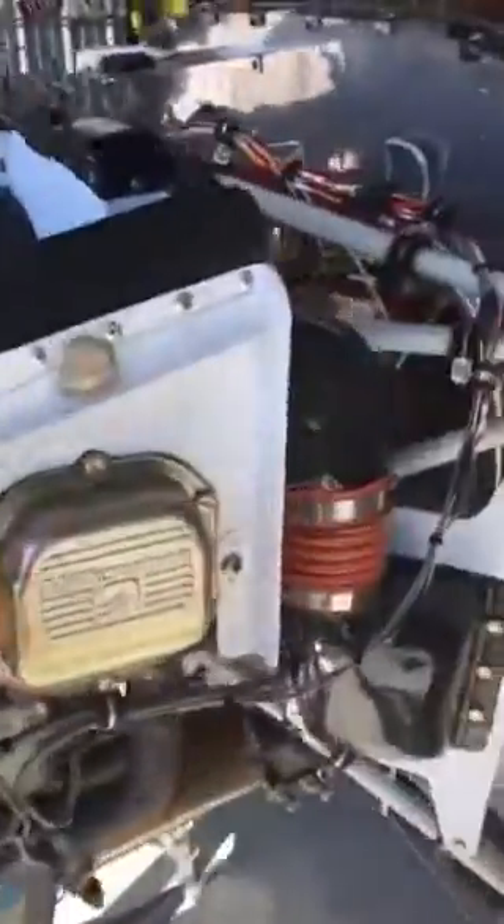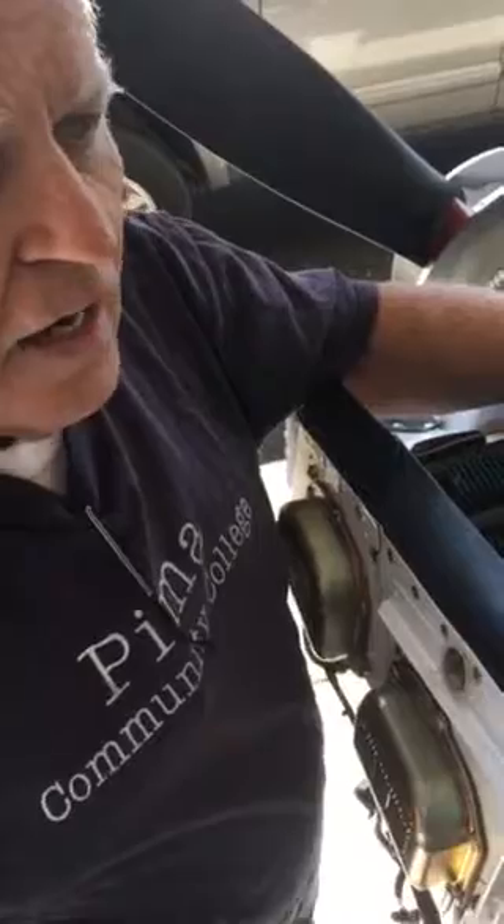Let's briefly describe how you would do that, assuming they weren't timed properly. There are two bolts on all mags — up here on the top of the mag and underneath. We would loosen up the mag that is out of time. You can tell which one it is because the green is the right and the red is the left mag. If one is out of sequence — one is coming on before the other — we address the one that is not on the correct timing mark.